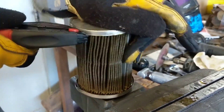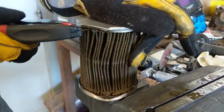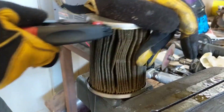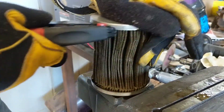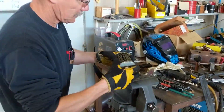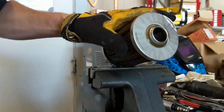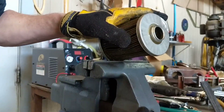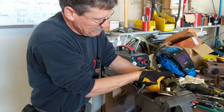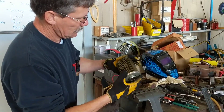With a good knife, you start at that metal band — this is after the filter has been cut with a good filter cutter. Slide it all the way around, then go adjacent to that metal band and crimp that in the vise. Break that off, blow that away, and go adjacent to that metal band.